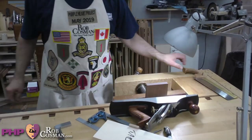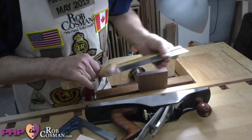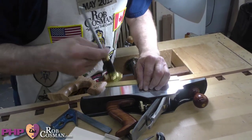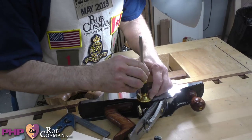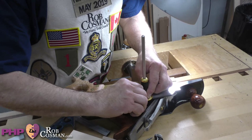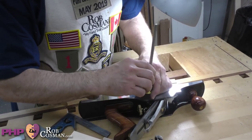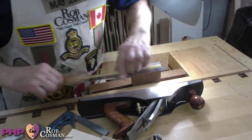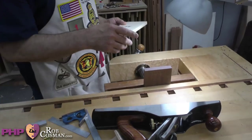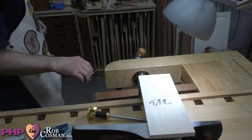Now we need to measure the saw blade. So I like to set it down on something hard. Don't measure out here. I want to measure on the main tooth. I like to be able to drop it down like that so I hear it. Careful not to twist the tool down like that when you're tightening it. You want that to be an extremely accurate mark, and I mean extremely. You're working in less than a thousandth of an inch on this. If you screw something up, you're going to pay for it.